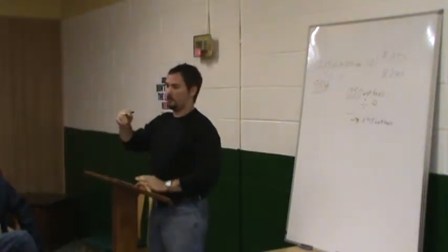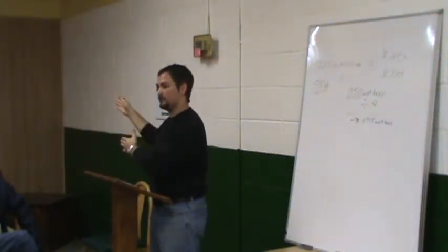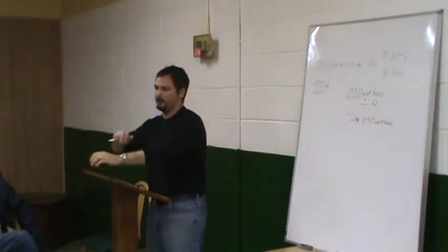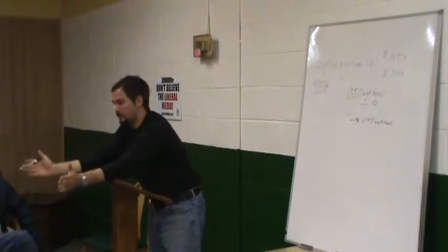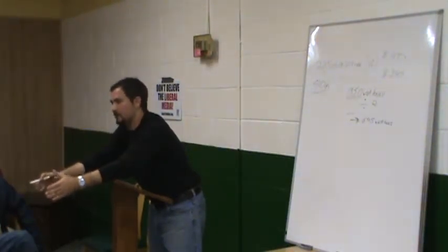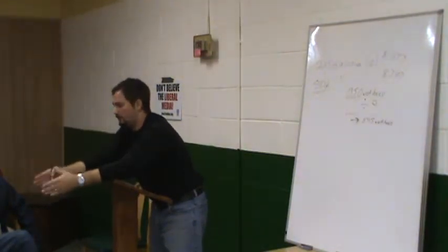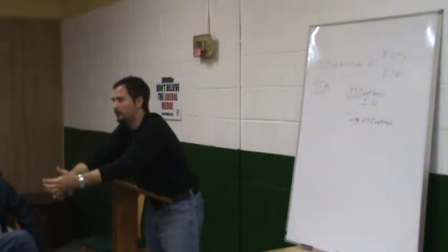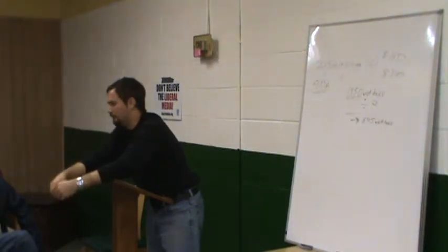is what takes the power from the batteries and turns it back into AC voltage or plug-in voltage. That's what I call it. You plug it in. That's what my wife calls it. Plug-in voltage. It takes it from 12 volts, which is what your battery bank will most likely consist of for a small system, and turns it into 115, which is the standard household outlet. It ranges from 110 to 120, but 115 is the standard for just about 95% of the appliances, whereas 230 is what you'd use for your stove or your clothes dryer. Most inverters output at 115 AC. Okay, that's what the inverter does.